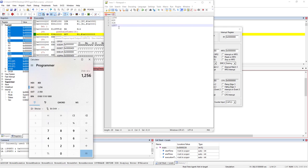Again, you can think about what happens when we make this PD too high or low. What happens to the resolution? What happens to the accuracy of our measurements? You should be able to think about that. If a large frequency were always better, we would have always gone with that. Or if a lower frequency were always better, we would have gone with that. Why do we need these different options? You need to give it a thought. Basically, think about what happens to the maximum value, how much time we can measure as a function of the frequency, and also the accuracy of this measurement as a function of the frequency.